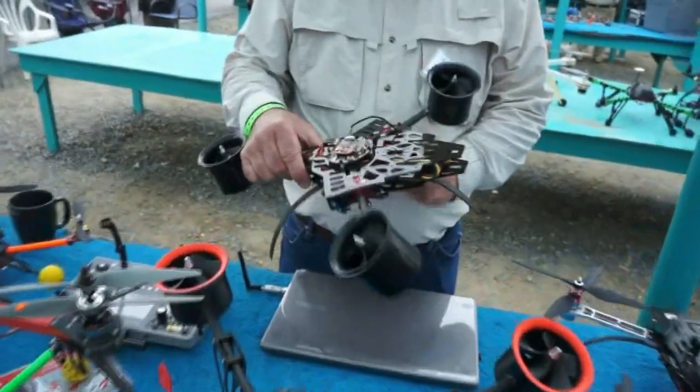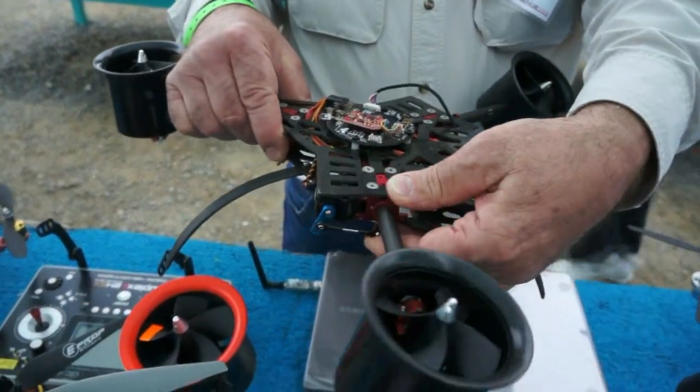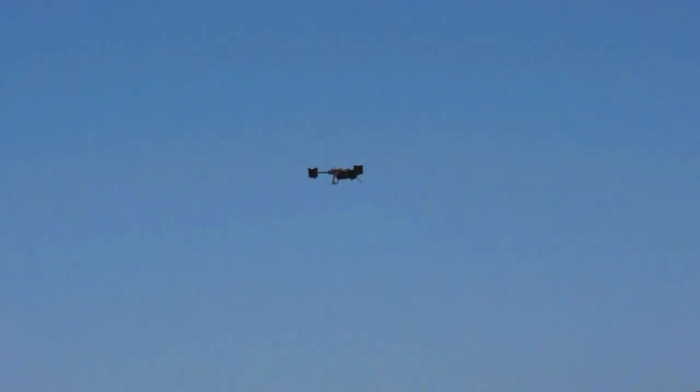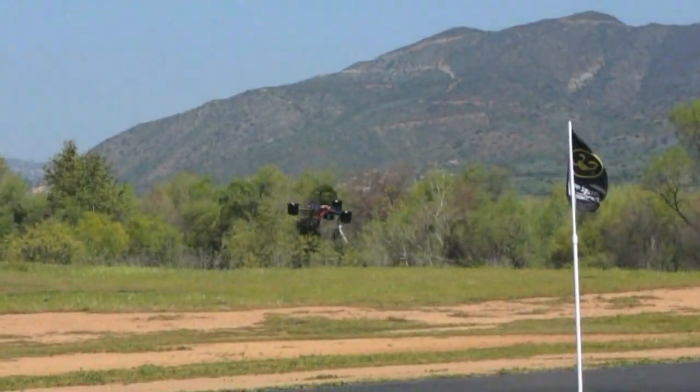I also did the Avatar with ducted fans. That's another one that flies real docile and really nice. It uses the rotation of the EDFs for yaw control, which takes the yaw control mix out of the motor mix and makes it a lot more stable. It'll take any flight controller that'll do a tri-copter — it thinks it's a tri-copter. It's just that these two servos are linked together like you do with your ailerons.